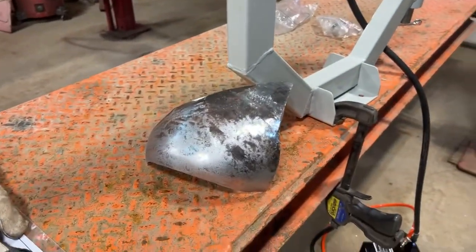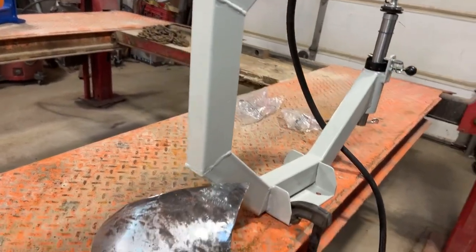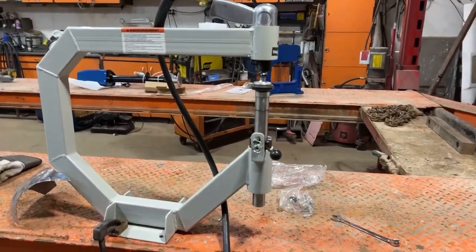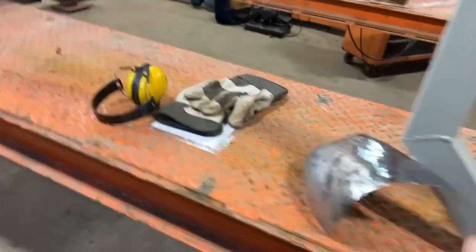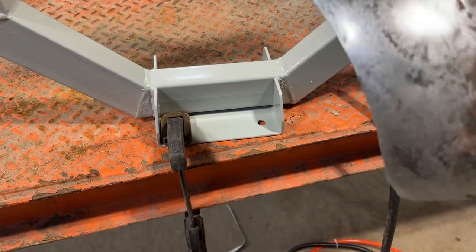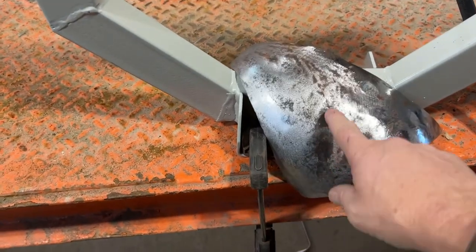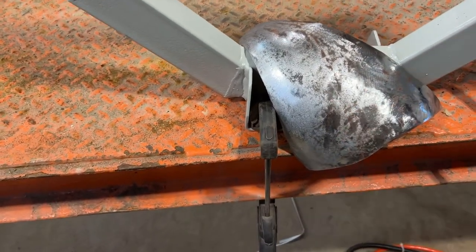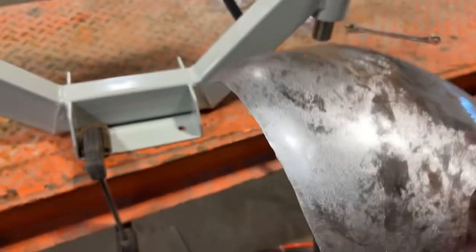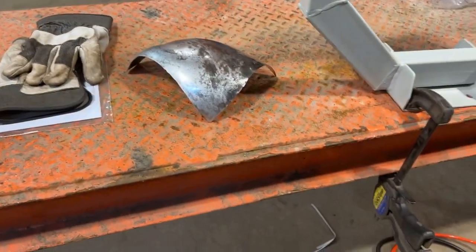This isn't the best — this is by no means a make-it-customs product. By comparison, his is really nice. But I've got something I can make do with, because that's what I do — I make do with scrap metal and that. The whole trick here is you can't be doing this stuff with paint and rust all over it, although I did my best to clean it up. It affects how the finish turns out. But honestly, when you're sanding, you can tell there's a low spot in here. A guy could actually work that out more. Mind you, the English wheel — if I went to the English wheel now, I could really tune that up. These are things I'm moving back into the shop in a couple of weeks. I'm satisfied with that.